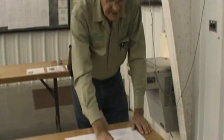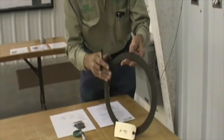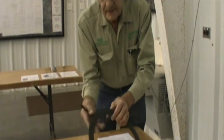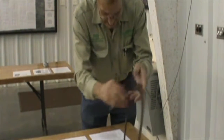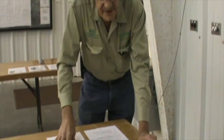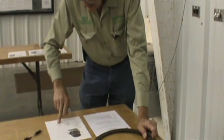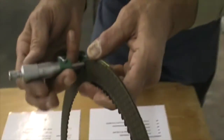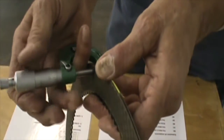This is a fiber disc. A while ago we reviewed the separator plate. The separator plate would actually go up against this on each side. When it compresses, the separator plates compress together — this is what actually grabs. Looking up specifications, it should be 0.127 to 0.133 inches. We mic it and we have 0.131 inches. So it is within specification.